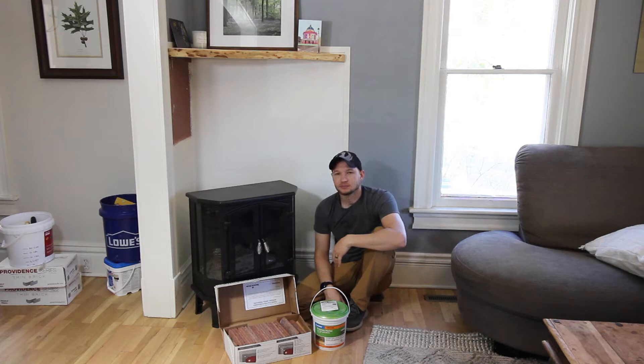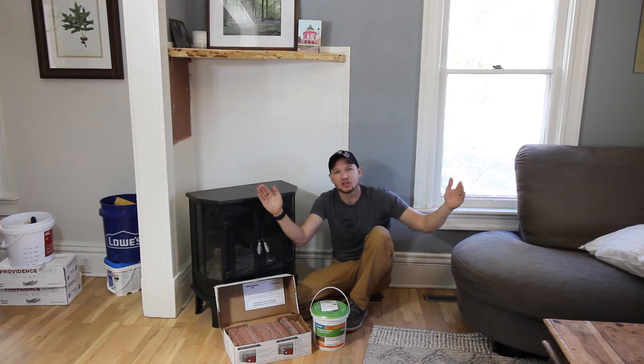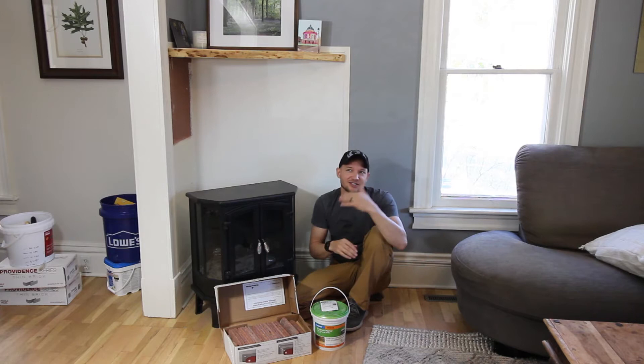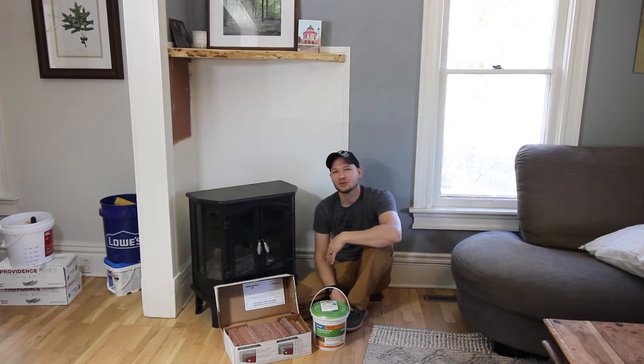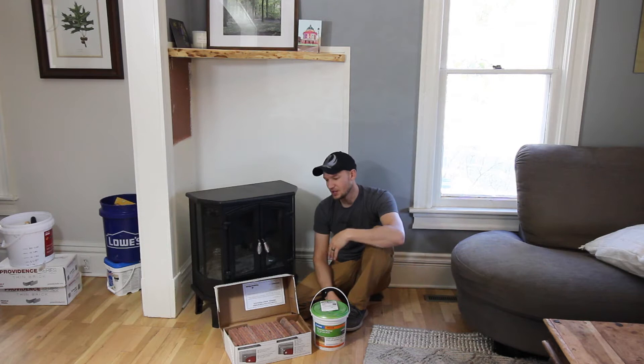I am using three-eighth spacers. If I wanted a perfectly straight row of bricks, I would cut a piece of wood — a three-foot long strip of three-eighth or quarter inch, whatever my gap was — and put that across all the bricks to keep everything perfectly straight and level. But since this house is from 1903 and everything's a little bit off, we wanted to go with a more traditional style, so I'm not going to be OCD about having everything perfectly straight. Things are a little bit jagged — that's what I'm going for. Let's get started.